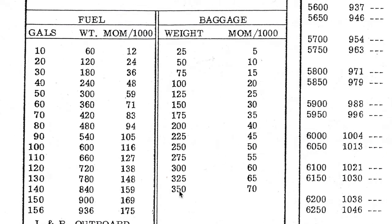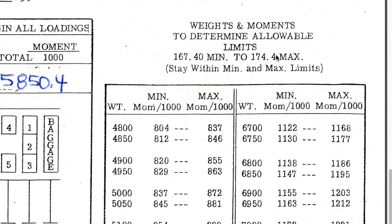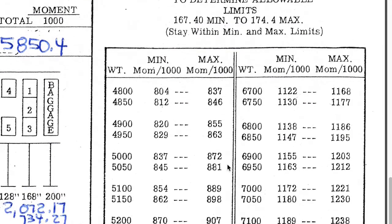The baggage area can hold a maximum of 350 pounds. I used that area and took 350 into 70,000 to get the CG for that station — these are all static so it doesn't really matter which values you pick. For this airplane the stations have a minimum and maximum load limit, and since they're all linear, no matter which values I divide I'll come up with the same arms: 167.4 and 174.4.